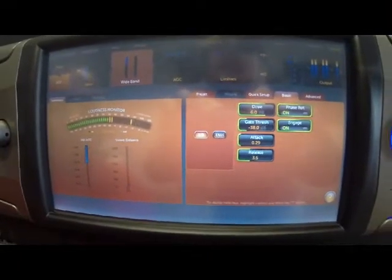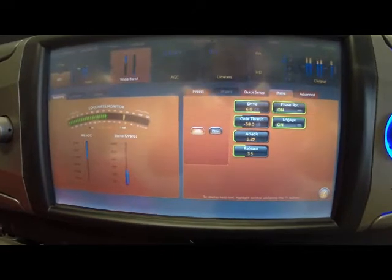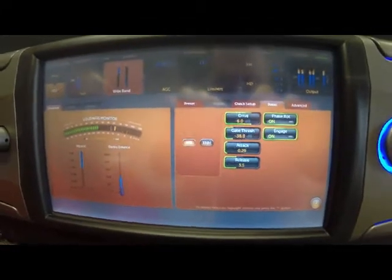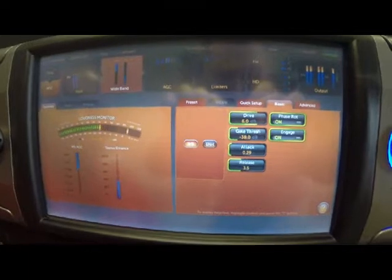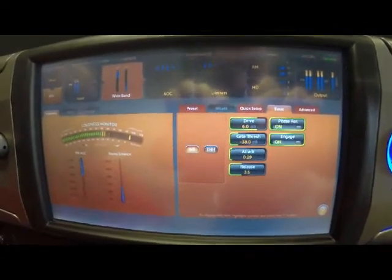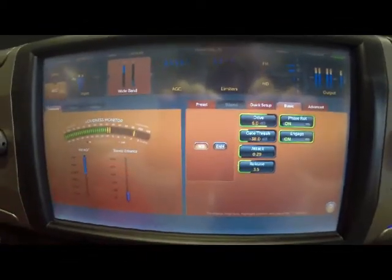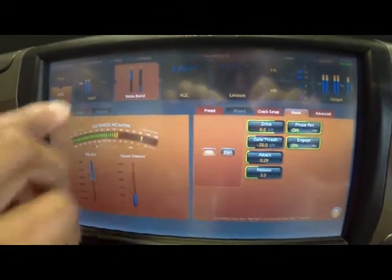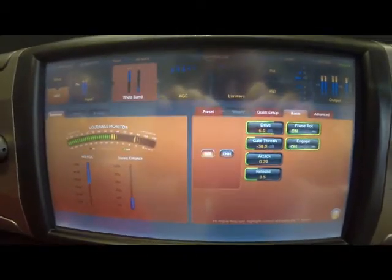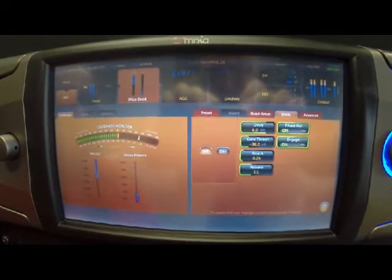One of the most unique features of the Omnia 11 Wideband AGC is that it operates with the knowledge of what's happening in the multiband spectrum. From that information, it's able to adjust its time constants, attack and release times, appropriately for the spectrum content it's seeing at the moment. We're not doing this by wrapping information from the multiband AGCs into the wideband — many people assume that's what it is, but that's a very unstable way of doing it. The Wideband AGC has its own multiband analysis tool as part of its own section, allowing it to work freely and independently of what's going on anywhere else in the audio processing chain.